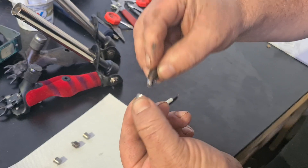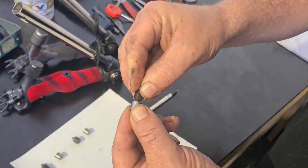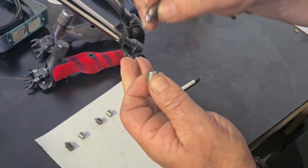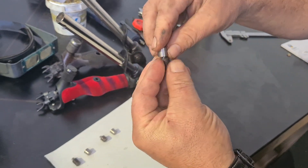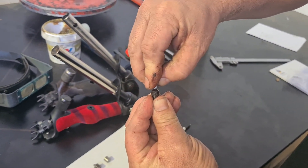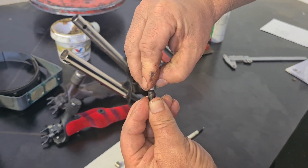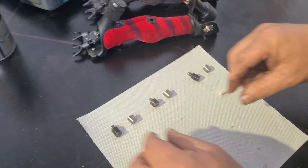Now obviously it's metal on metal and it's not getting lubricated properly by a lot of people. If it doesn't get lubricated it wears out really quick. You've got your tension down so you're screwing your fork down tight into that post and cup — your fork comes down on your cup, screwed down nice and tight, and it's going like that all day. So if you don't lubricate that it will wear out really quick, and we have some perfect examples of what happens.